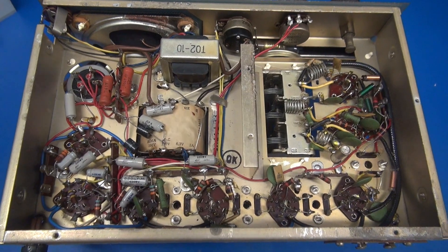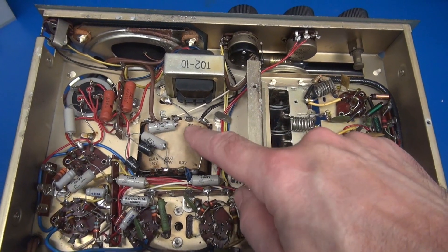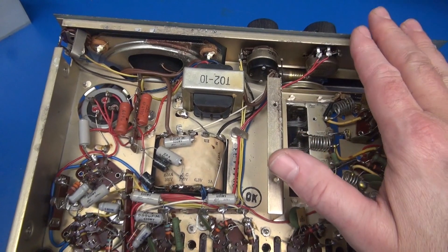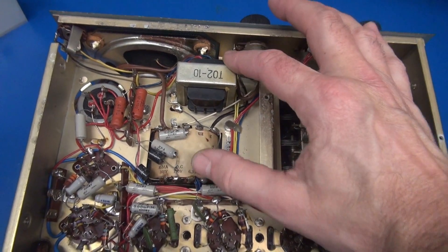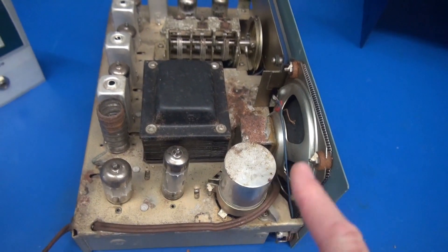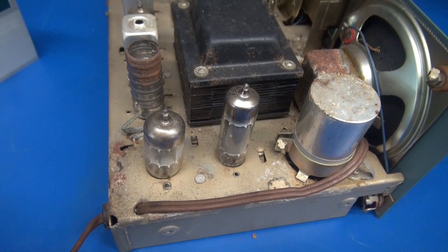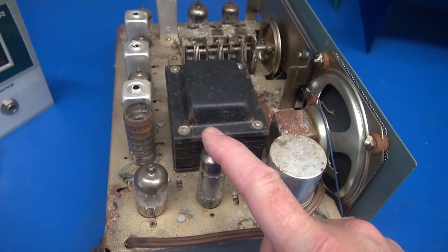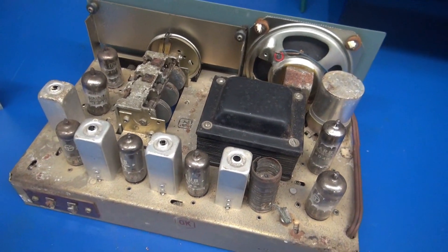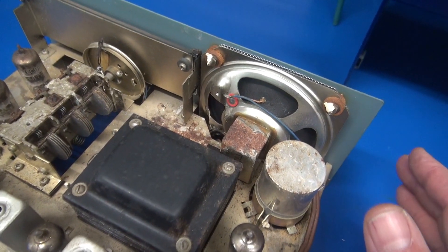If you flip them upside down, there's a lot of components under here that you're gonna be cutting out and not using, but the heart of this machine will be the power transformer and, if you wish, this output transformer. There's an audio output tube and that is a 12AX7 preamp. So if you really want to cheap out, you could use this audio output tube with the existing transformer and the preamp tube — this thing would probably give you approximately a watt and a half of audio output, which is about all that little four-inch speaker could deliver.